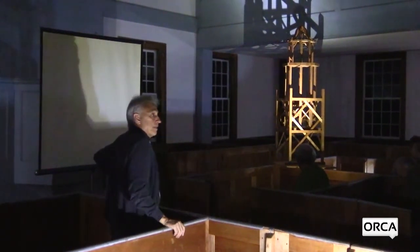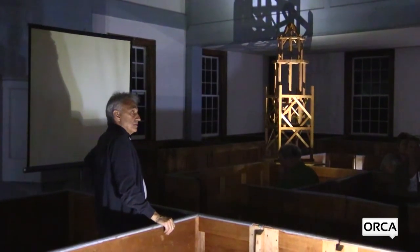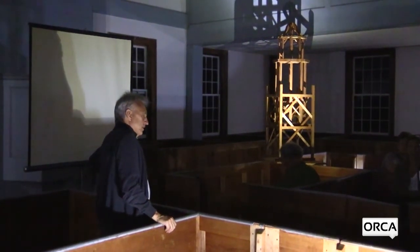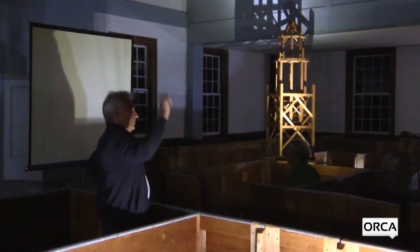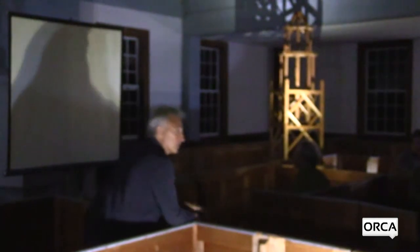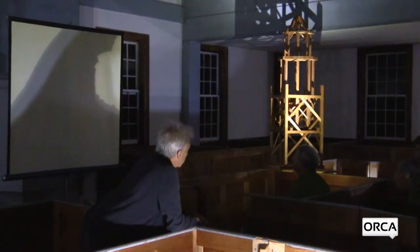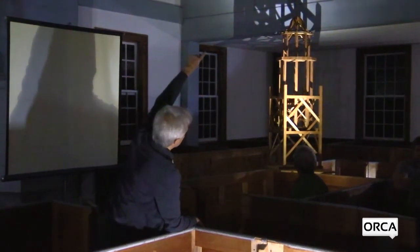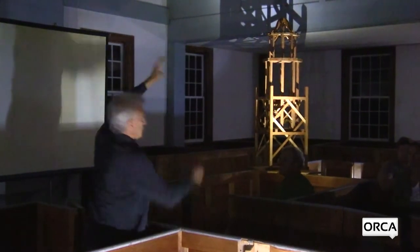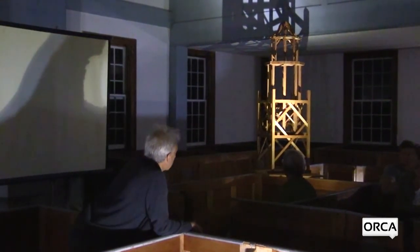Jen, do you use a crane to prepare this to be lifted off, to get beams up there? Maybe just a boom truck. I may haul stuff up to the attic, but I may just have enough stuff on the ground, get a smaller boom truck to bring stuff up and drop stuff in on us. We'll move them around. I don't need the big crane. But the big crane I need because we have to have rigging that goes way above the ornament and is out far enough from it so you're not pressing against it, you might say.